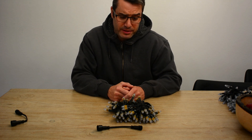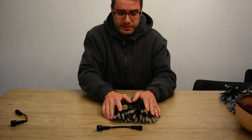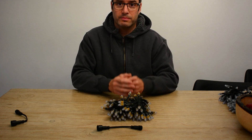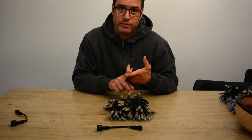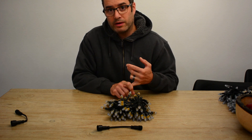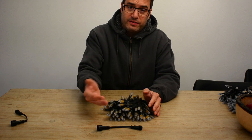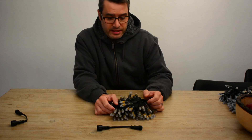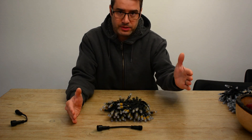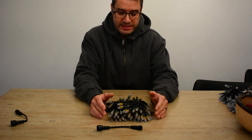I thought it had to be a power injection issue, so I got some power injection T's and pushed one of our infinity spinners with 1450 pixels across four ports: pixels 1 through 400, 401 through 800, 801 through 1200, and 1201 through 1450. At the end of each 400-pixel run I added the power injection T, which brings power back — effectively giving 400 pixels with a connection at the front and power and ground at the end.